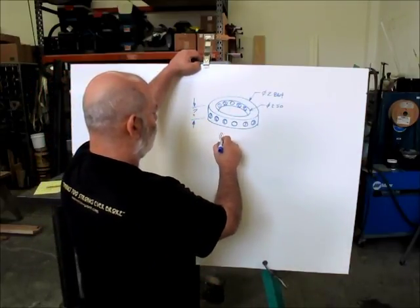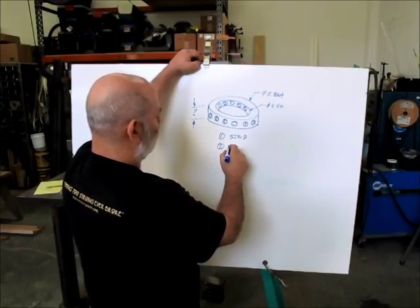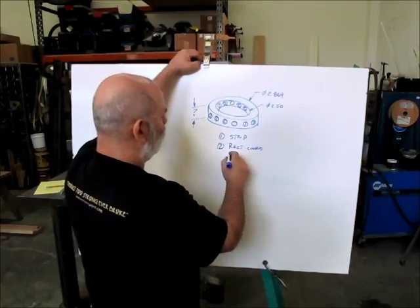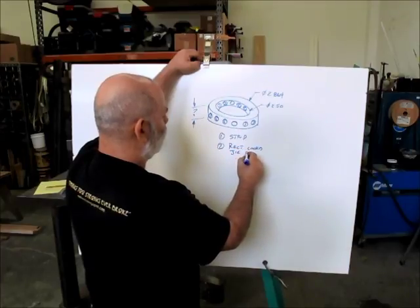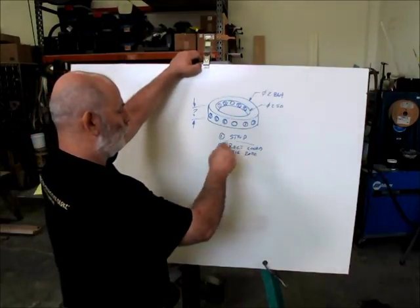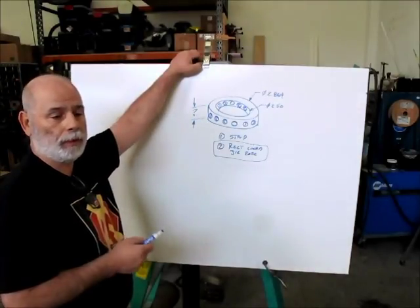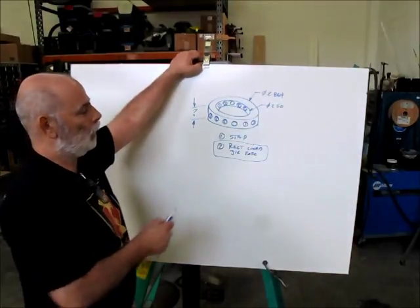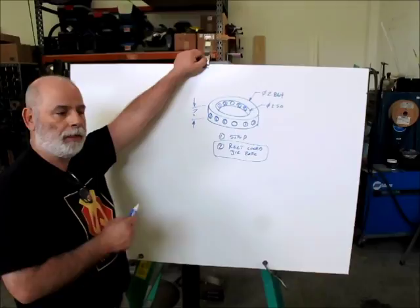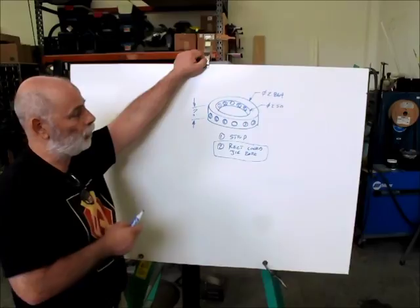The two methods we're going to show, one is what I call the strip method, and the second is called the rectangular coordinate, or the jig bore method. This one's pretty straightforward, although it's kind of backwards from how it's normally used, but it still works for our problem here. The strip is more interesting to me anyway, because it's a kind of geometrical method for dividing up this ring.